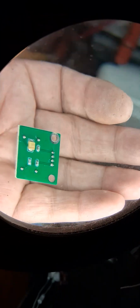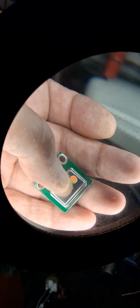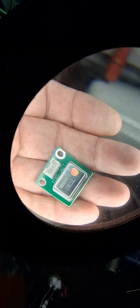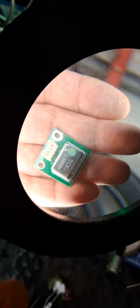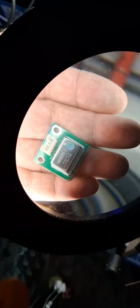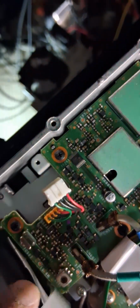So there is a little adjustment. I'm going to have to pull this little foil off, put it on 10 megahertz, get the oscillator running, and get the flutter out. Make sure it's stable. So we're going to install this, plug it in, and isolate some of these pins that are in here so they won't be touching. Stand by.